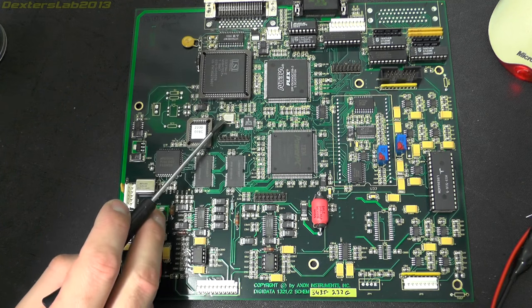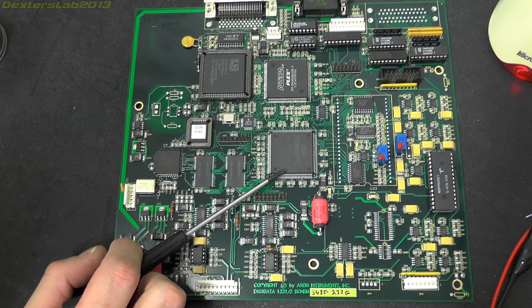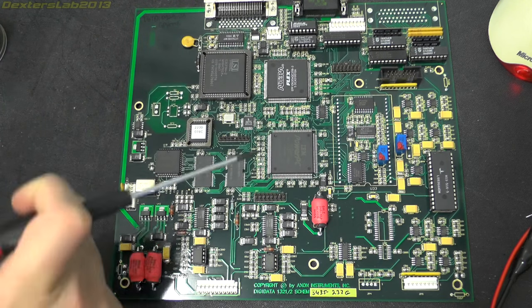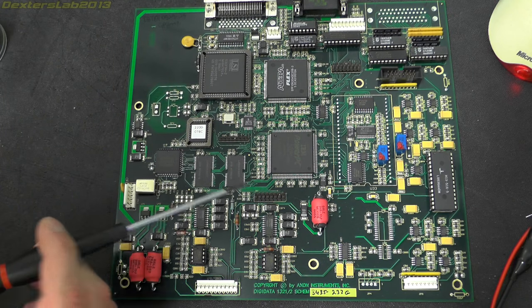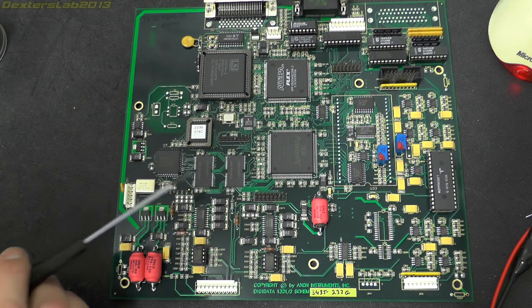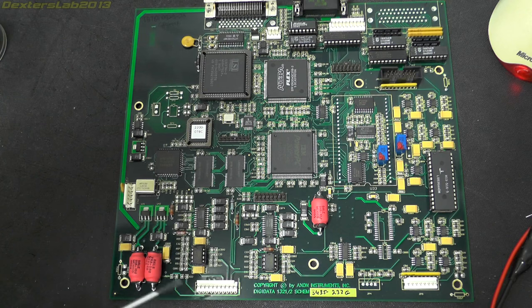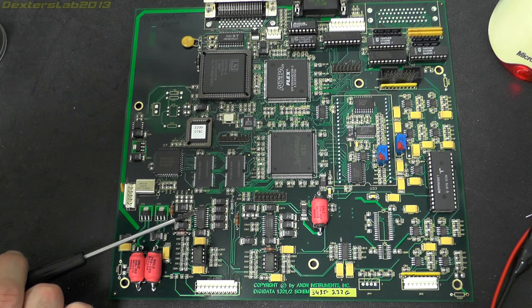The next large device is an IBM PowerPC 403GA, which is a 32-bit RISC embedded controller — so it's not just a processor, there will be a whole lot more in there than just a normal processor. These two devices here are SRAM — they seem to be 128K each. We've got a little bit of analogue stuff going on here: some Burr Brown OPA op amps and a small Burr Brown PCM1702, which is a stereo audio DAC — interesting to see that in this kind of device, the sort of thing you'd normally find in audio grade stuff.